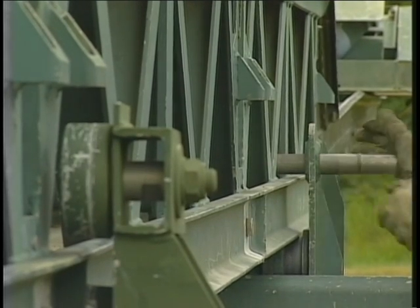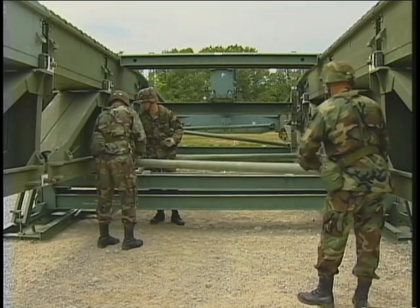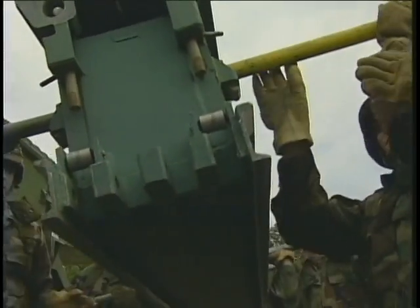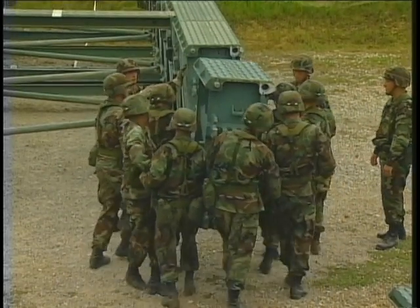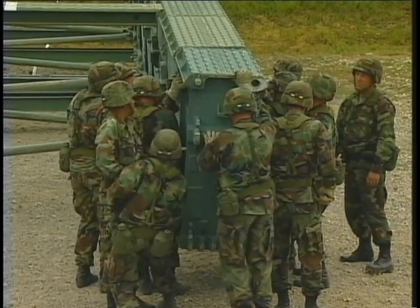After adding the fourth bay, use bracing pins to connect two supporting sway braces continuing the zigzag pattern. Continue adding bridge bays and sway braces to form the remainder of the bridge. You can begin assembling the rear end of the bridge, connecting components as you did at the front end of the bridge.